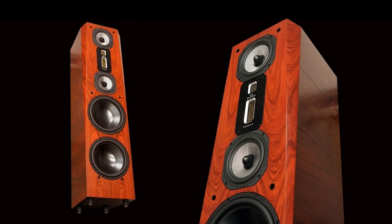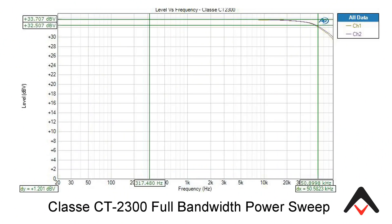So again, a six ohm one-channel-driven rating is a BS spec. We should at least have a two channel rating to pay homage to the old days of stereo, because at minimum when you're running a system you're running at least stereo front speakers, and most of your power draw comes from those. What I like to do is sweep from 20 to 20 kilohertz, finding the point at 1 kilohertz at 0.1% distortion. At low frequencies, bass uses a lot of energy due to long duty cycles, and you can see problems if the power supply isn't adequate. At high frequencies — especially with digital amps — years ago Pioneer used the ICE module, and because of restrictions of the output filter, it would collapse above three kilohertz into a four ohm load.